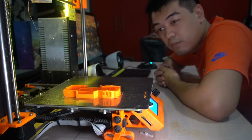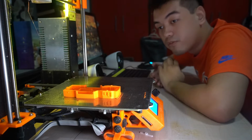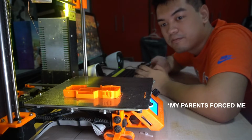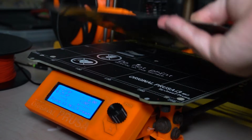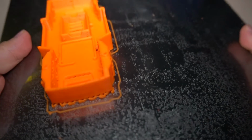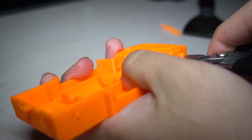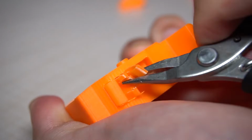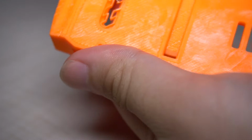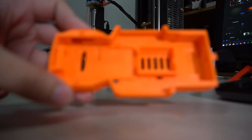The thing about 3D printing is that it takes a long time to produce something, enough for someone to get a haircut. Like me. Taking a print off the heat bed is made much easier with a spring steel plate, though there may be times we might still need our spatula. Removing the supports also felt satisfying. In this print, I forgot to properly set the retraction value, so I could notice a bit of stringiness. However, cleaning it off is a simple step.